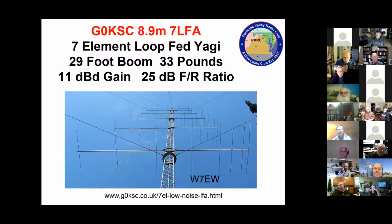I will tell you, only a few people have built these huge rotating towers with very large numbers of 6-meter beams. And at least one of these was taken down shortly after it was built because the owner discovered, just as you might guess from the early part of my brief presentation, that only rarely do the very high antennas contribute anything of value to an array like this. So my recommendation to people who want to put up an array of stacked Yagis is to put up a shorter rotating tower, certainly no more than 100 feet high, with 2 or 3 stacked Yagis, and forget about this stuff of using 6 stacked Yagis on a 150 or 200-foot tower. It's just not worth the enormous effort.